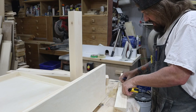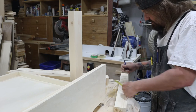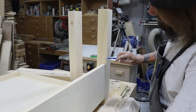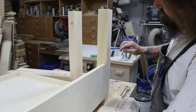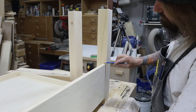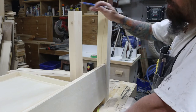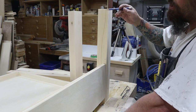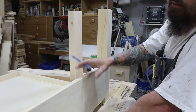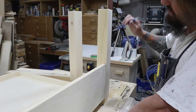The mattress size is 6 inches. So basically, your side rails, front and back rail, are going to start at this height here. So you're going to have a 1-inch space. The side rail I'm going to make is 3 inches, but I'm going to put a platform for the mattress on the inside, 3/4 of an inch. And I'm actually going to do the same thing I did here. I dropped this panel down. So I'm going to mark this up 3 3/4 inches.